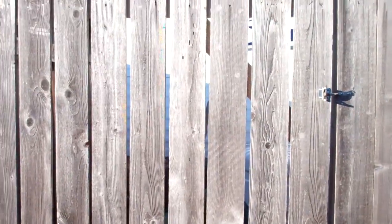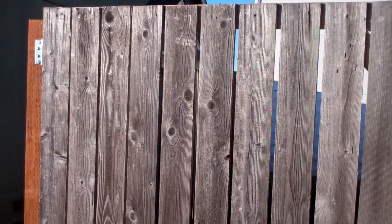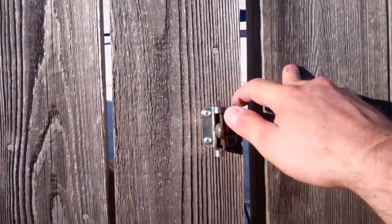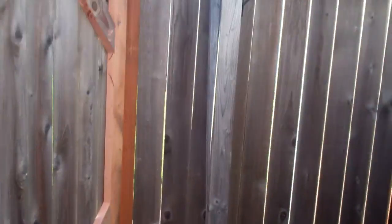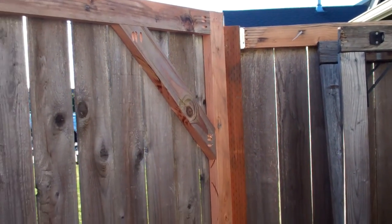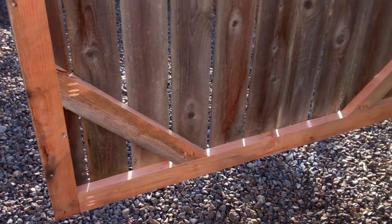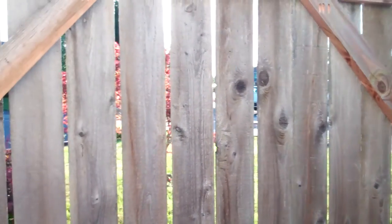Okie dokie peeps, it's the end of the day — the fence is done. Last step, I had it on the ground, got all the 45 angle braces in there, laid the slats down on it and just nailed them up — pretty simple. Here it is all nice, tops all flush with the other one. Got the little latch on there that's super kid friendly. This one sagged a little more because that pole isn't really secured well — it's part of a line of the fence. I was able to screw the other one into the house really well. I had to readjust the hinges, but it still doesn't need any wire or anything — it's pretty stout. Hopefully that'll help you out. If you have a sagging fence, you can just redo it, put some bracing in there, and if you have a Kreg jig you can jig it all up.